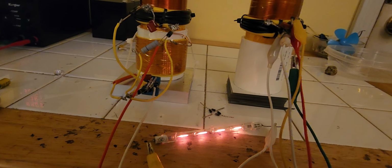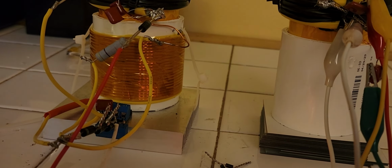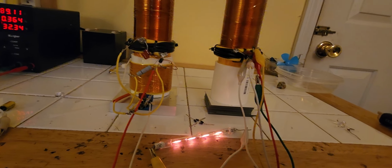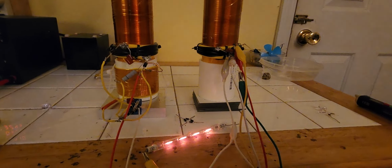So it's a heavily modified Slayer circuit with negative resistance built in. Basically, once I short it out, hopefully you can see that, the bottom of that extra coil is shorted out to where all of the other connections in the circuit terminate to get the circuit to oscillate. I'll add this connection to the PDF and the circuit diagram.